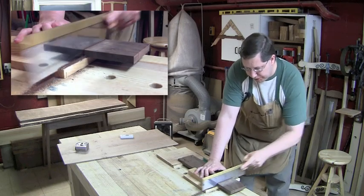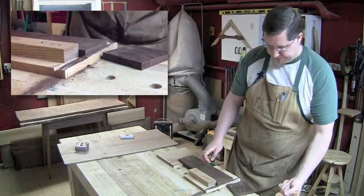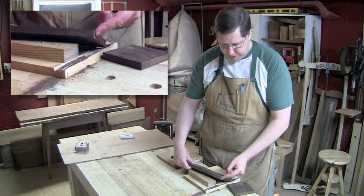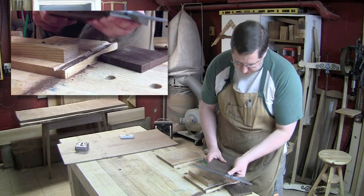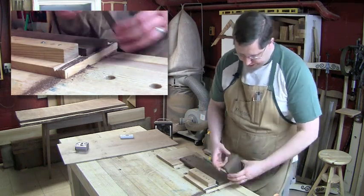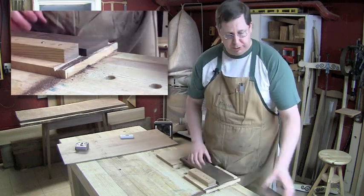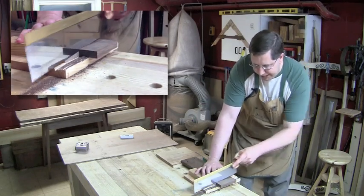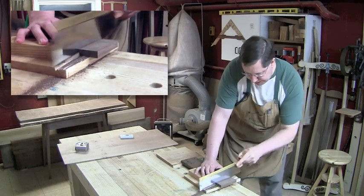And this is Peruvian walnut, so it's pretty close to the hardness of, say, hard maple. And I've got a perfectly square cut in this direction and dead on my line in this direction. So when I check it, I'm square and square. And importantly, the quality of the cut is really quite smooth. This saw is basically cutting exactly the way I want it to cut, and just the smoothness of it, it's definitely a sharp saw.